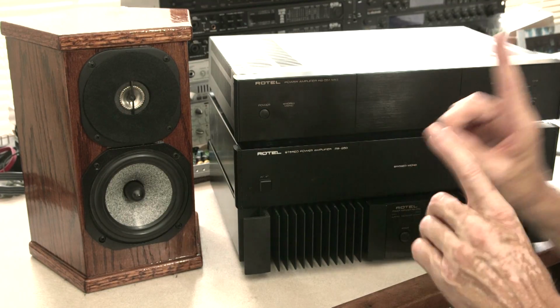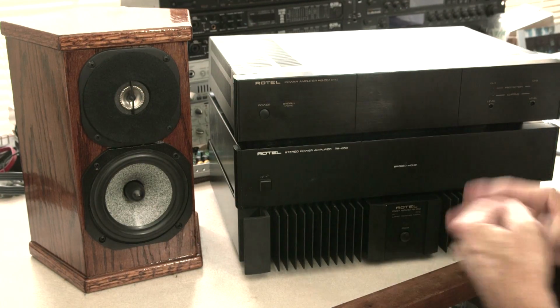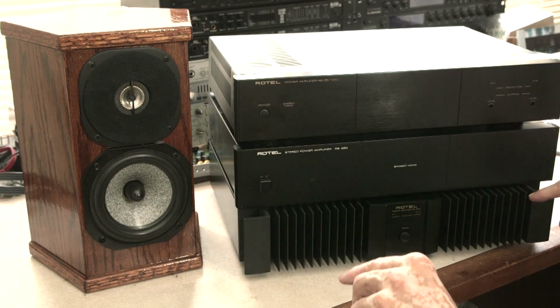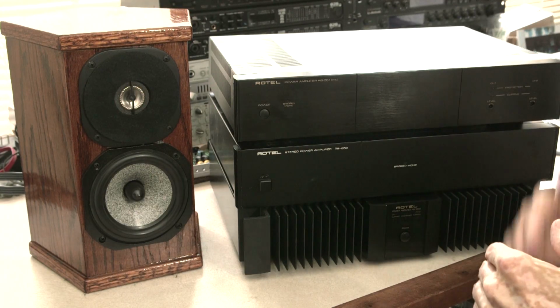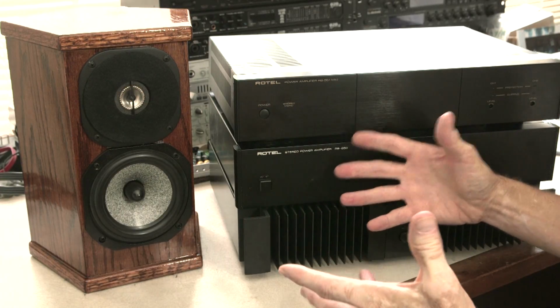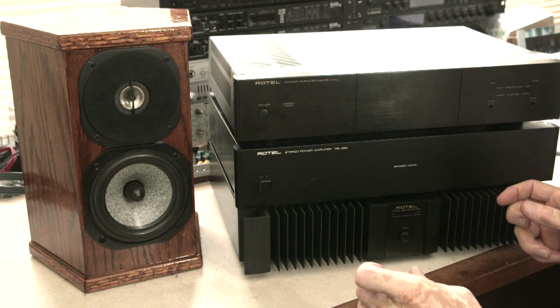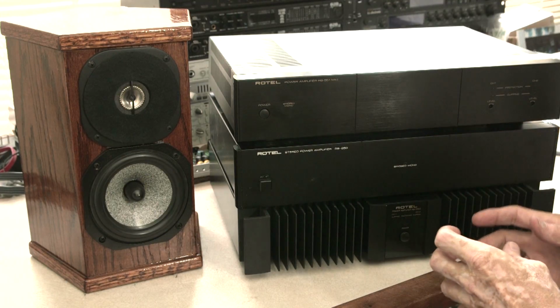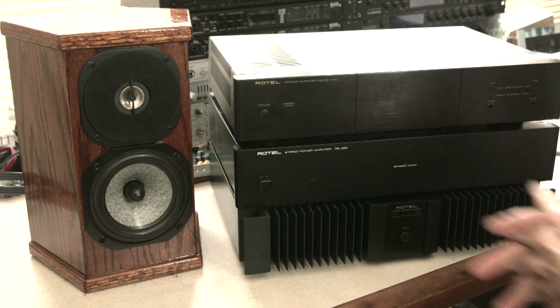No amplifier has just a single amplification stage. It has multiple stages of amplification. That's why we had multiple 12AX7s at the front end and then a push-pull 6L6 output. You need to amplify the signal in a number of stages to get up to a point where you can drive speakers with it. But anyway, he would have tube, and he has amps that he builds for this. They're ridiculous money, but tube front end, and then he has transistor output.